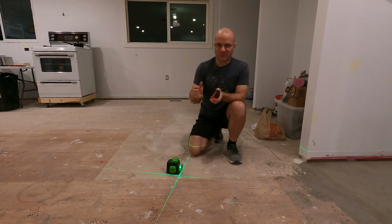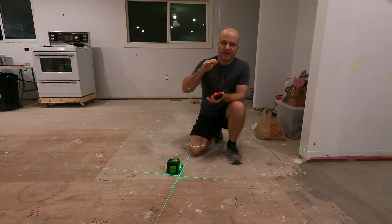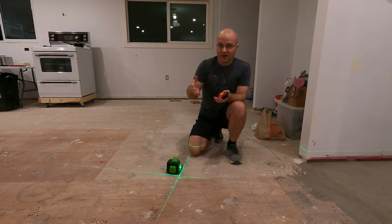That 4-inch number is really pretty arbitrary. It was just a good middle ground between too low and too high. If I choose too low a number, I end up having to do a lot more grinding to bring the height of the floor down. If I choose too high a number, I end up having to do a lot more filling, which costs a lot extra on self-leveling concrete. Now that sounds like it's backwards, but I'll show you here how that makes sense.